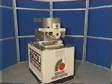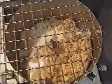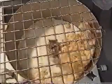But let's take a closer look at the Formatic. This is a standard model which has an output capacity of 2,000 forms per hour. Mix is contained in a 20 kilogram capacity hopper, and this is gently pressed down into the variable depth form shape by twin synchronized paddles.